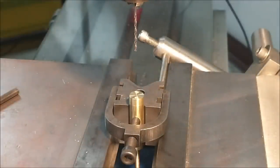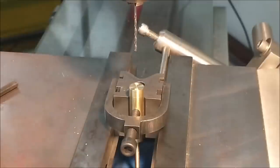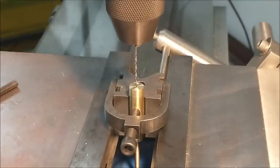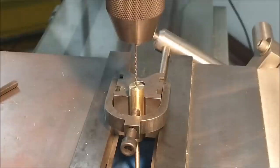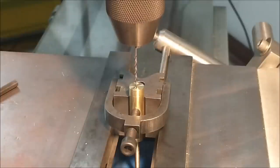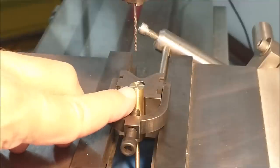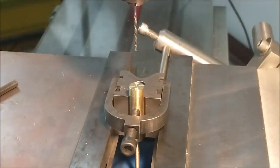Going to raise the table the thickness of that particular tool bit. The drill will now be exactly on the center of the top of that, or level with the top of this part, and I'm going to make the hole about 15/1000ths shallow of the thickness of that straight section right there. This is 190 thick. I'm going to go 175 on the depth.